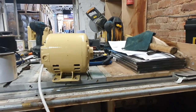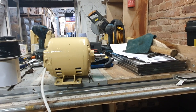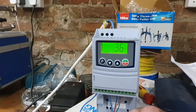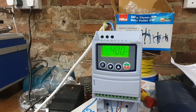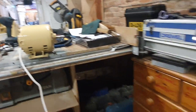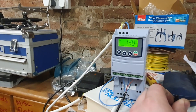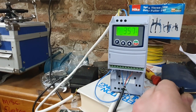Let's just dial that right down to minimum — 3.6 hertz. There you can see we should be getting — I would say that's more than 3.6 RPM, but that's what 3.6 hertz is going to deliver. So let's wind this up — you'll hear the motor. We're up around 60 hertz now and she's doing her thing, spinning nicely. I'm really quite pleased with that — we have a functioning variable frequency drive.